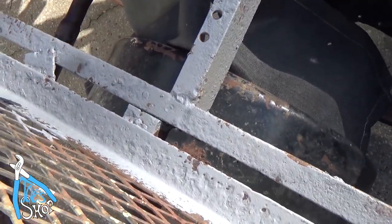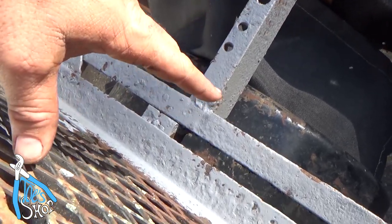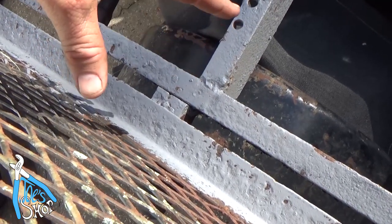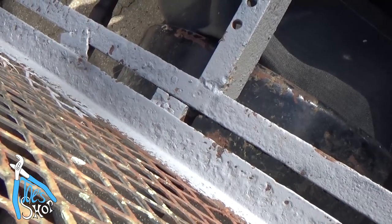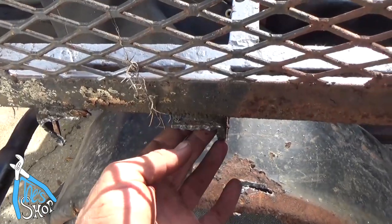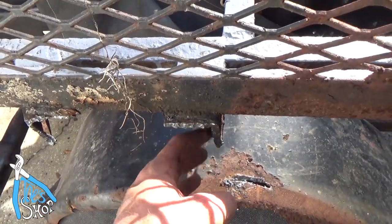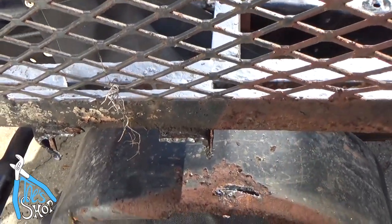They may have, I don't know, this is all conjecture. But I'm guessing that when it was welded and it was hot, maybe they hit it with a garden hose to cool it down. Because the welds are super hard and they're wiping out my Sawzall blades. So I've got to stay away from the welds with the Sawzall blades. And in the short sections like this, there's nothing but weld. So I'm coming over with the plasma cutter and zipping these off. And I'm not good enough with the plasma cutter to make a really straight cut yet.